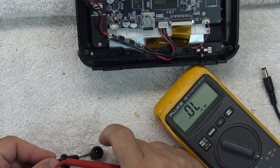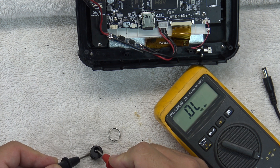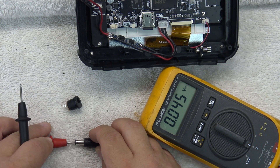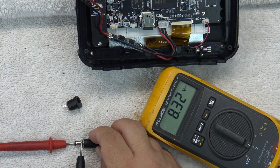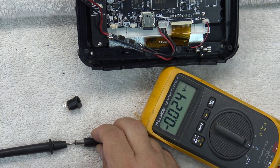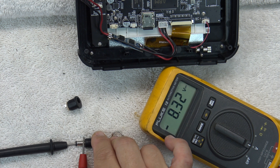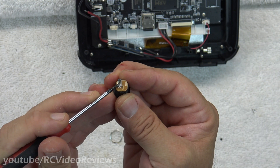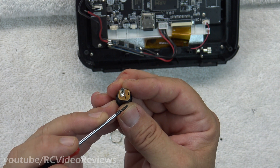There's the lead on the back that's supposed to be the center pin — I'm just going to do a continuity check. That center pin is hot. The last thing I want to do is check polarity on my plug, so I'm going to put my positive lead on the inside and just touch the outside — 8.3 volts, so the polarity is correct. Positive is on the inside, negative is on the outside. In case you're wondering what reversed looks like — you'd see negative 8.3, that would be reverse polarity. The lead with the rivet is the hot lead, and both of the others are ground; you can use either one.